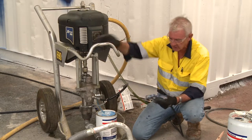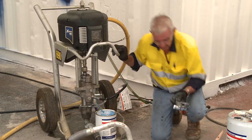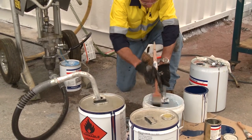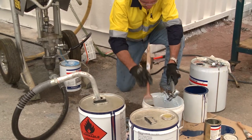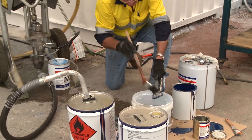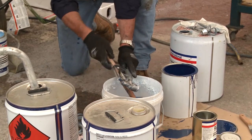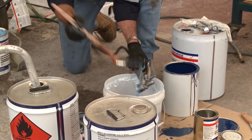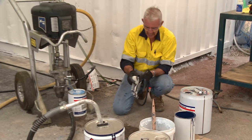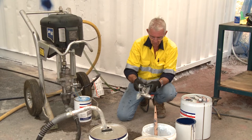Cleanliness is paramount as far as this equipment is concerned — cleanliness is everything to ensure its operation happens every day. We give the gun a rinse because I keep these guns as clean as I possibly can so I can ensure it's easy to inspect. Check for cracks around the back of the barrel of the gun and the stem around through here — it can crack through there because it is cast. So we make sure we keep all this nice and clean. The one thing to remember when doing this is the safety must be on to ensure you don't squirt yourself with thinners or solvent. With the safety on, give it a rinse and a wipe — that's how your gun should remain all the time. If I was using a product that was drying quickly, I would have a wash pot nearby to periodically rinse all this and keep it clean.